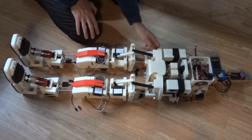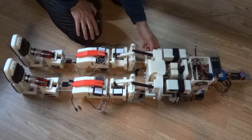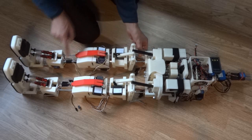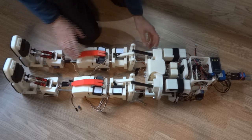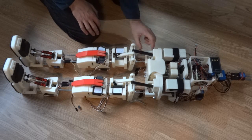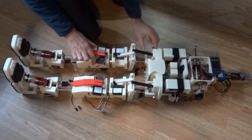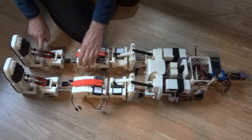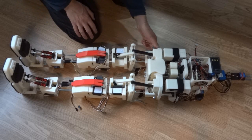I've also replaced the knees with rigid links, which we'll look at in a moment. The whole Android has been built in quite a modular way on studding, so I can swap out sections quite easily. In fact, what I'm going to do is build new legs around the actuators and then replace the knee, hip, and ankle hinge modules with linear actuators.